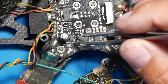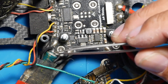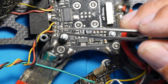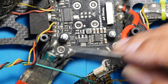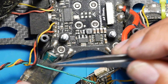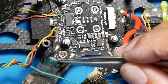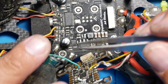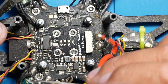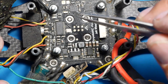As far as wiring goes, you're going to have four ESCs all the way around. You'll wire your ground and your positive, and then you have three little wires. If you're running KISS, which is what this is designed to run, you'll come right off the ESC in line - it's going to happen just like that. If you lay your ESC face up with the LED facing up, you run straight from here to here. If you're running 6S, be sure to use a cap - you'll see I worked one in here, make sure you do that.